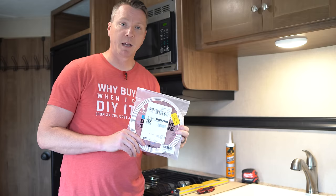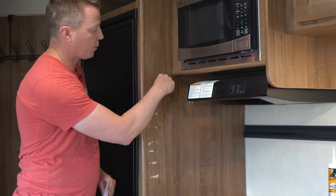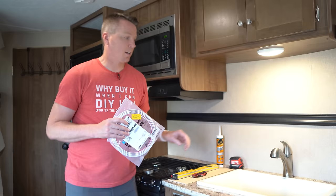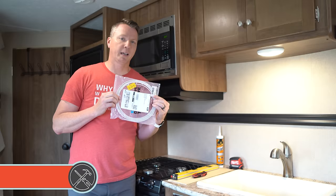The edging material lets me take care of unfinished areas — I'm going to be tiling all the way up to here and I don't want an unnatural exposed line, so I'll put some edging there. If I also want to separate my heat-resistant tiles from the subway tiles, I can use this edging between them, and I can also put it on the other edge where it runs off toward the counter. It just costs a few bucks and gives you a nice clean finished edge.